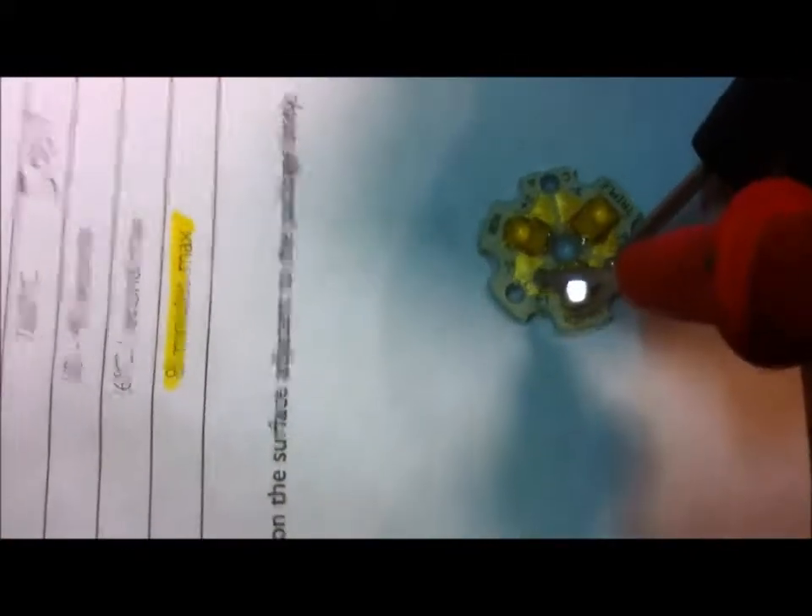You can see some brown flux off the sides. I think I did put a little too much solder on this one, but I think it'll still work. Using diode check mode to check for electrical conductivity — that one's fine, that one's also lighting up. And I have a problem here — something has shorted out. I have too much solder paste and the anode and cathode have probably shorted out, which is a real nuisance on this Rebel. I'm going to have to try again.